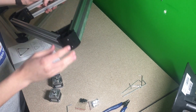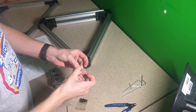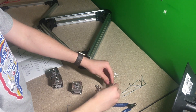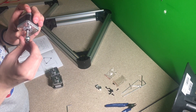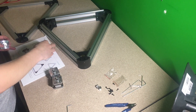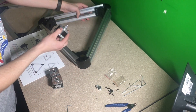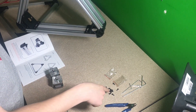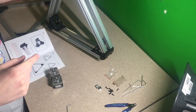Okay, so I have them all attached. Now we'll get the screws in. Next we're going to do the stepper motors — we have the three gears and the twelve screws that attach them. First off, we're going to find the flat edge and line that up with the one set screw, and that's going to go in like this. We'll tighten those down, then plug the motor in here and attach it with the four screws. Once I'm done with all of that, I'll be back and we'll go on to the next step.